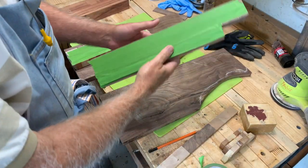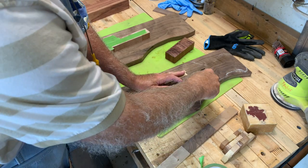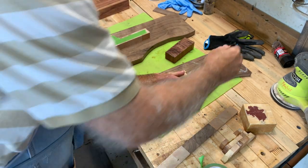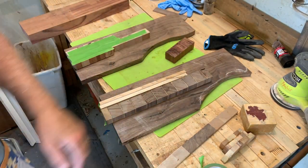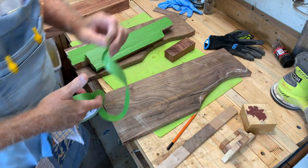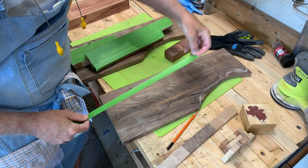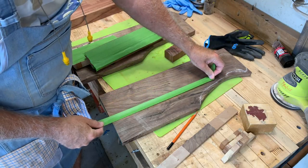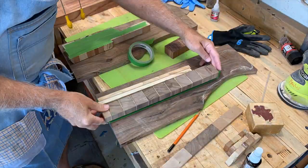Take a piece of the offcut — I've already put tape on one side of it — position it on the piece of walnut where I want it to be and kind of strike a line to get an approximate location. I'm gonna do the glue trick on the painters tape to get it to stay while I put it through the bandsaw. After I have the tape on I put a few blobs of CA glue on there.